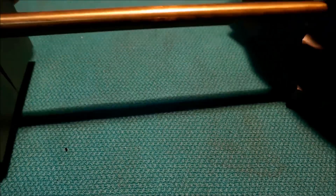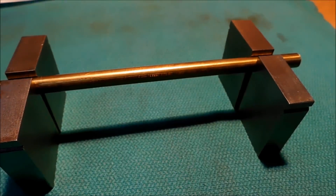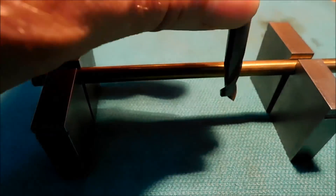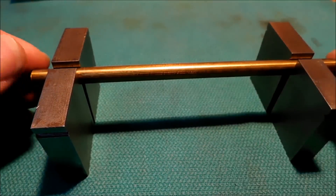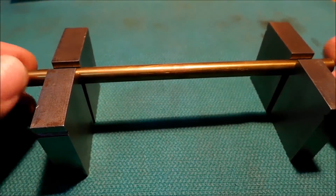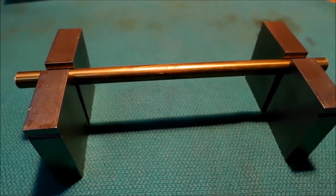Two on this side, two on this side. I'm going to pull this camera back so you can see that. And that just works so well in the vise — it's just amazing the amount of access that this gives you to your part. You can cut the top, you can cut the back side, front side. You can make half rounds that are beyond center that you couldn't hold normally in a vise, because once you get beyond center it pops out. So let's stick this in the mill, modify it a little bit and show you exactly how that chain is going to happen.